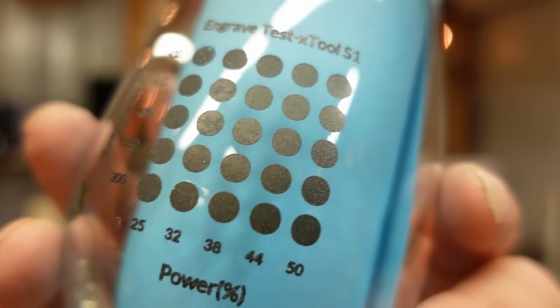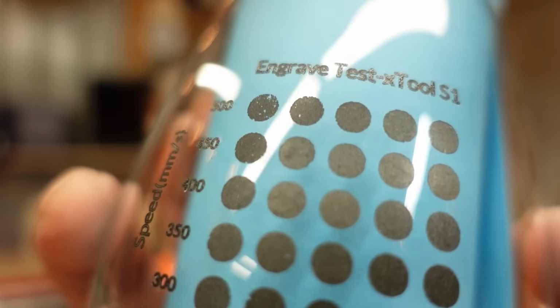Make sure you take some rubbing alcohol or some pure alcohol or something and clean any oils off of the glass before you engrave, because people handling them in the store and stuff like that can prevent the Cermark from sticking, and it'll chip off. And you'll see some of that because I didn't properly clean the glass before I engraved them. But you won't make that mistake because I reminded you. So there you go. But yeah, you can see some of the Cermark is chipping off.